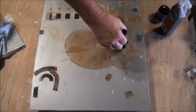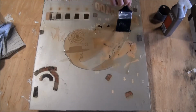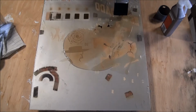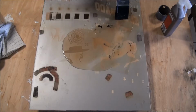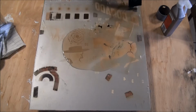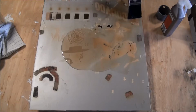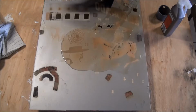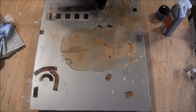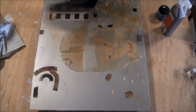Now where your glass is flaking, you want to just barely be touching the glass. You really only want to be spreading the Markseal and not even touching the glass. Like up here in this corner, which is a bit delicate, just get it over the top of it and it'll run into all the cracks and openings. That's another reason you have it elevated, because drops will go over the side. Don't worry about those. That'll all dry off.